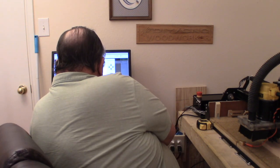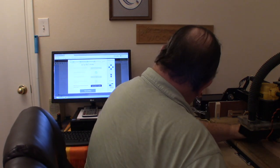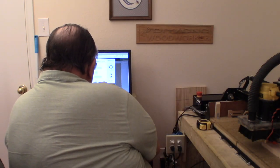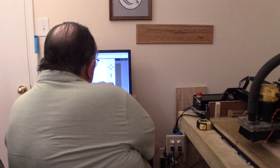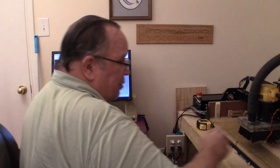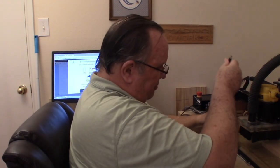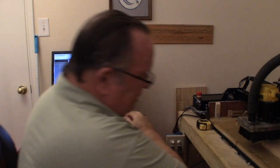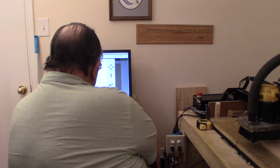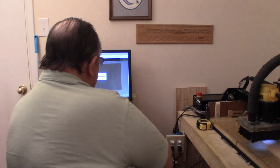Confirm position. It's hooked up, clip is attached. Touch the cutter. I have contact. Touch plate in place, start probing. It has probed successfully, which establishes my 0 point on the wood, which takes all the guesswork out of that. Probe is away, set the XY, I've done that already, I should say. Spindle is on. Start carving.